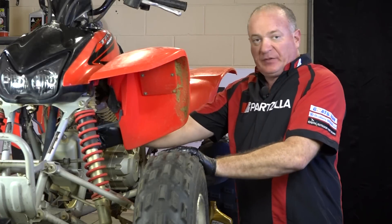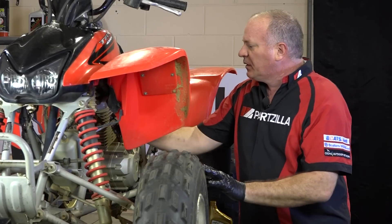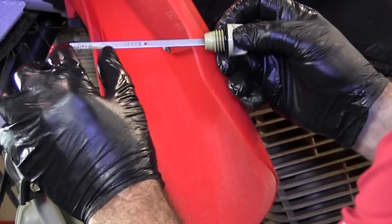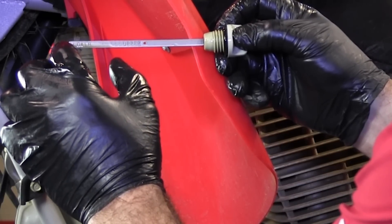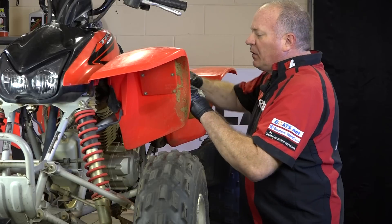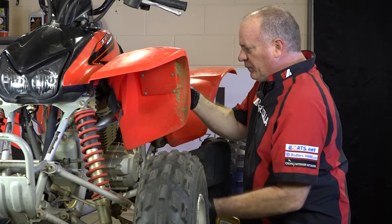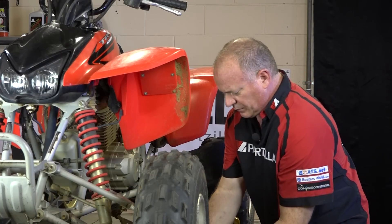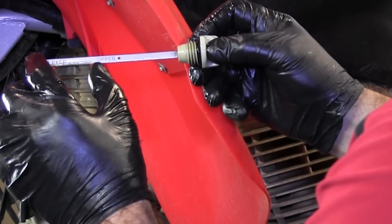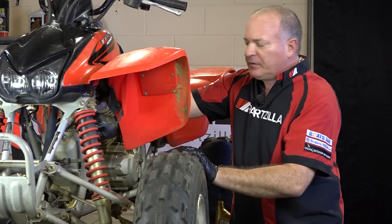Now she's sat for a couple of minutes — let's take a look and see where we really are. To check it, just pop the dipstick back in, don't screw it in, just pull it out. We are about at the halfway point, which is good enough, but I prefer to be a little bit more toward the upper level. So let's add just a tick more — don't get carried away — just to bring it up on the mark a little bit more, to about three quarters of the way up. Get your dipstick back in and snug down.